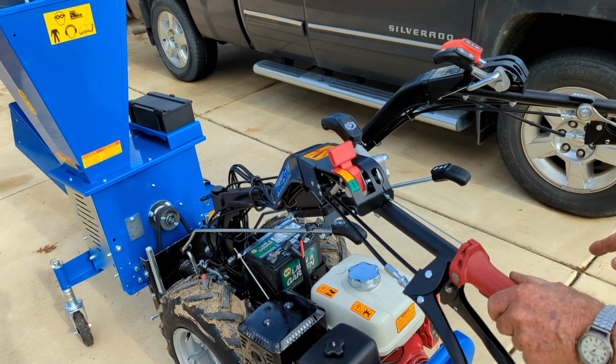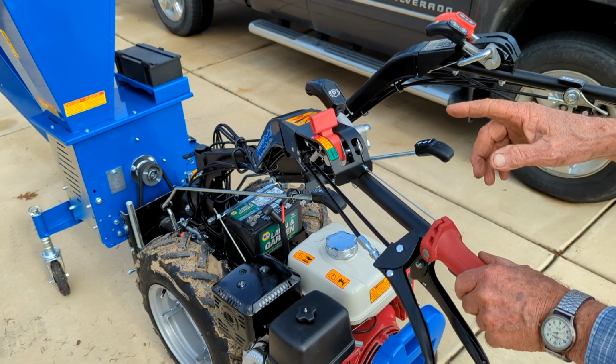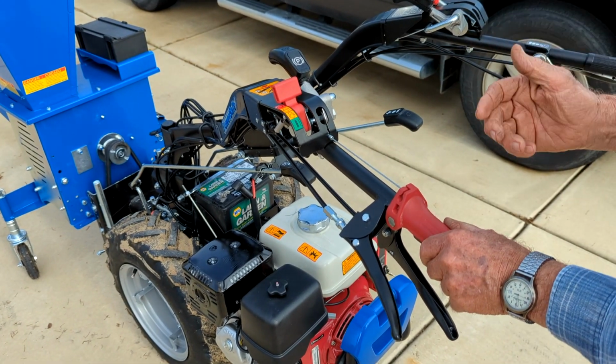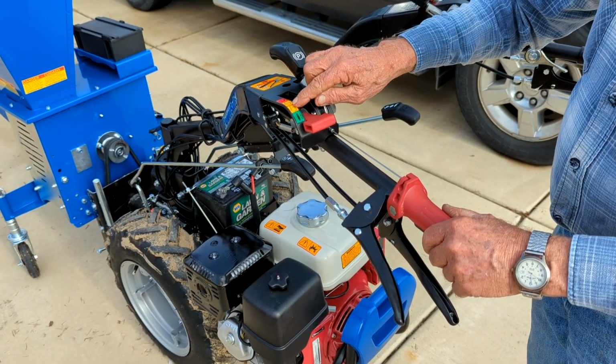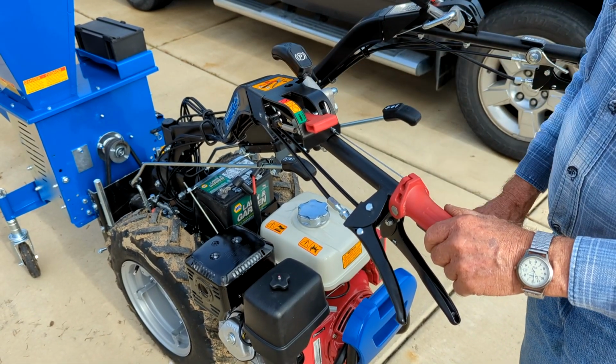Yeah. And it won't start. Don't crank it. Don't grind it. If it doesn't hit right off, look to see, do you need the choke? Do you need this? You know, whatever. So, yes, but that'll keep it from starting right now. I don't know what they got these other positions in here for, because it doesn't have an intermediate. It goes there or there.